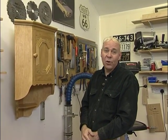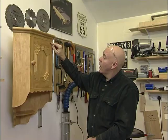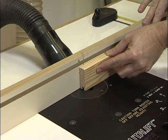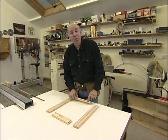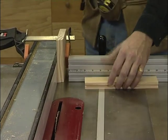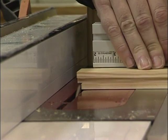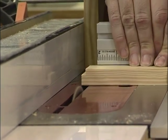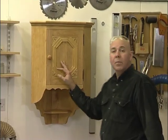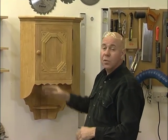The main feature of this cabinet is the door — a flat panel door, chosen so I could add octagonal molding around the inside and carved details in the corners. The style has a groove running all the way down the inside. I've cut grooves in both rails and a tenon on one of the rails; the tenon slots into the groove to create the space where the door panel will sit. Those tenons were cut over on the table saw using a reference stop against the fence for the correct tenon length, nibbling away the waste and then flipping to cut the other side. On the back side the panel is beveled — it's a raised panel on the inside — which makes for a more stable and stronger door.